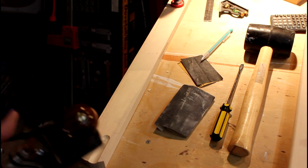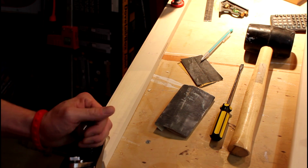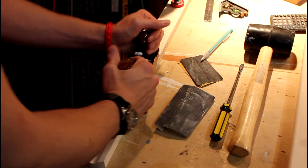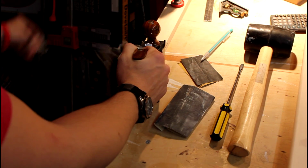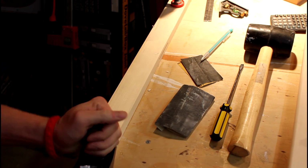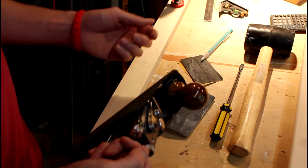Okay, so I have placed the plane knife back in the 33 block plane, and I'm going to give her a whirl. Oh wow. I don't know if you can see this, but look at that. Wow, now that's some real curls right there. Wow, I am impressed with this. So, just by using the Veritas honing guide or sharpening guides, I am able to have a $10 hand plane from Harbor Freight for my actual tool shop. This is something I would use.